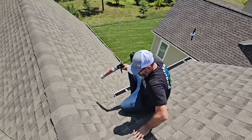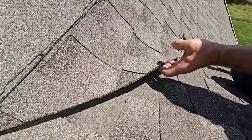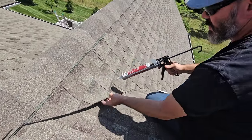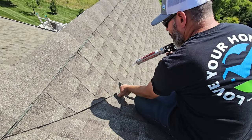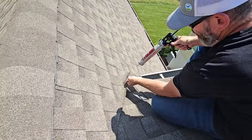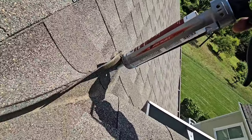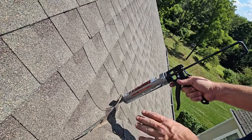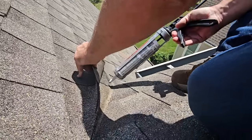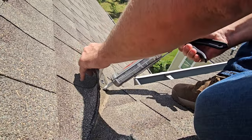In a valley area with this type of weaved valley, you want to put your hand in here and pick this up to find out how far they nailed away from the center part of the valley. This is great — they got a nail here, probably a nail over there. But this bottom piece — this shingle is kind of delaminated — and I always pick this up. See those nails right there and that seam? This is improperly installed. This should be a cross cut and then a weaved valley; instead they tried to weave the valley from the bottom up, so all the water is running here hitting these two nails and this seam.